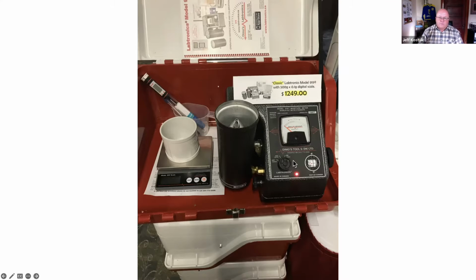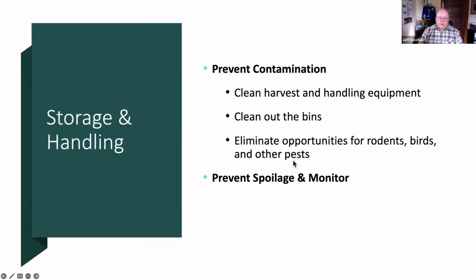So that's quite important. Then when we actually get hemp from the combine into the truck, dependent upon the moisture, if we get into the low teens, 12 to 13% moisture, I can fill a tandem at that point in time, putting two hoppers in. That might take maybe 40 to 50 minutes to fill. I'm comfortable with that, and then the truck gets going to the bin. Any higher in moisture, you might only want to do one hopper at a time from the combine.